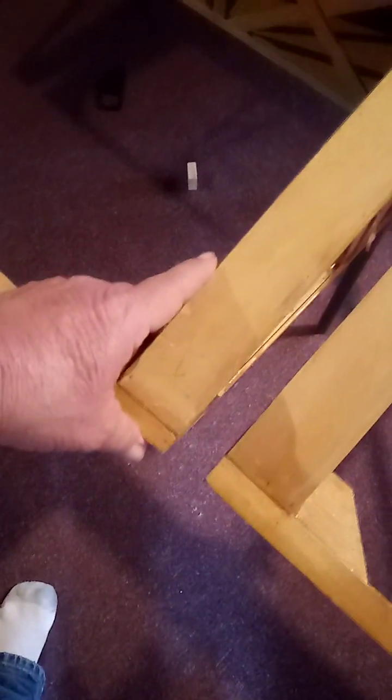This piece of metal right here is the hinge or control — the top is here and the bottom is over there, and on the bottom a fork goes on that for the pulley. This wing may already be set up with adjustment for different differential aileron built in. I know the manner in which these hinges have been done — it uses a piece of angle to another piece with a nut in it, allowing you to adjust the aileron up and down, in and out. It's a really nice hinge — simple and it works.